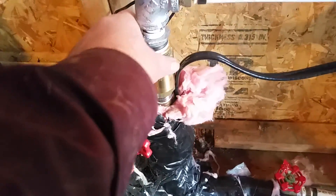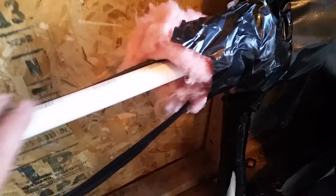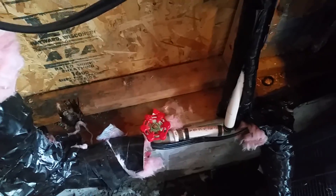You can see I just installed one here, and I'm also going to put another one-way valve in here. That should prevent what will sometimes happen: air will come in from the hose, it'll back flow, and get into the house plumbing.